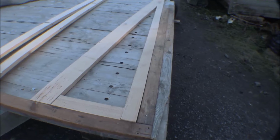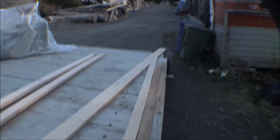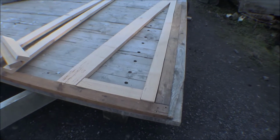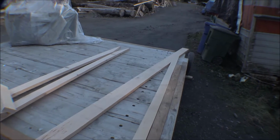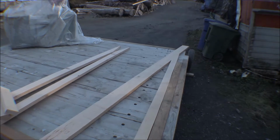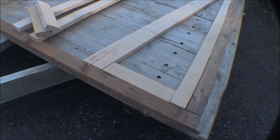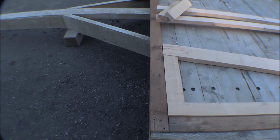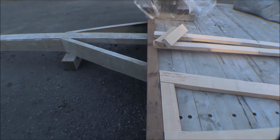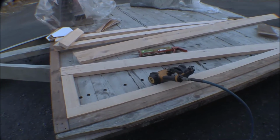And I put another 2x4 in here just to give me space there, because the rafter tails wouldn't clear that tire down there. So that 2x4 there is just a spacer. And then we got these 2x4s here that were cut to the length of the distance from the basement wall of the house to the outside edge of those 6x6s, the uprights. That should be that length. And then this 2x4, the short upright one there, that was calculated to give me 2 or 3 inches of space below the bottom of the windows that are in the house there, with that 2x6 stacked up on it. I've got everything laid out here now to build my trusses.